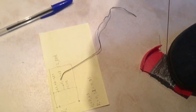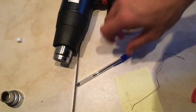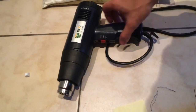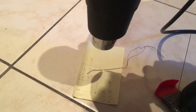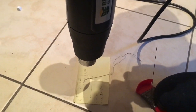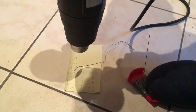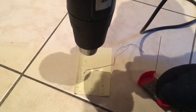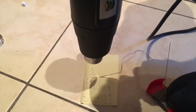I waited for the heater to be stabilized in temperature — about 30 seconds to one minute. Then I placed it over the piece of paper at the proper distance, six centimeters as mentioned before, and waited for the metal to fuse. I found this takes around 30 seconds in my case, and some parts of the metal will be completely fused after one minute and a half.